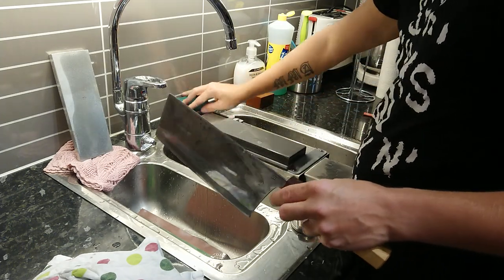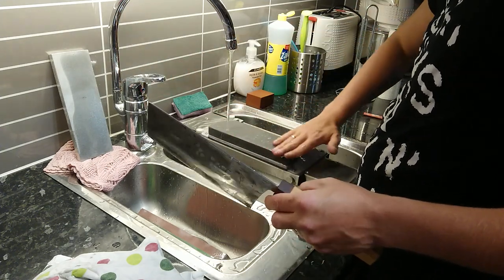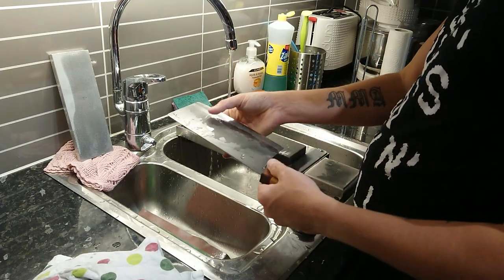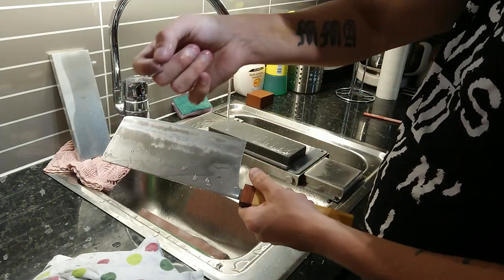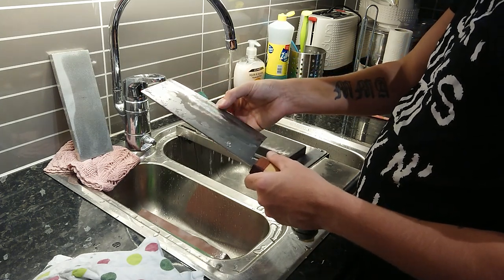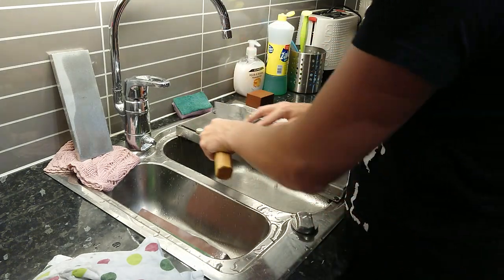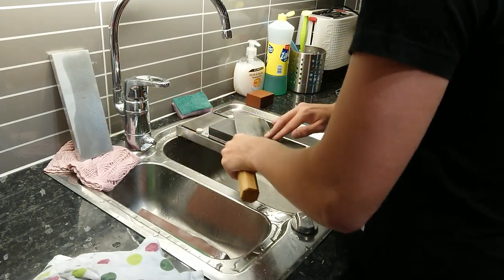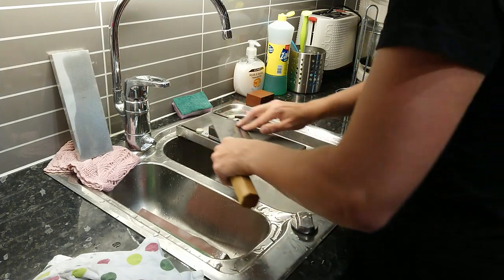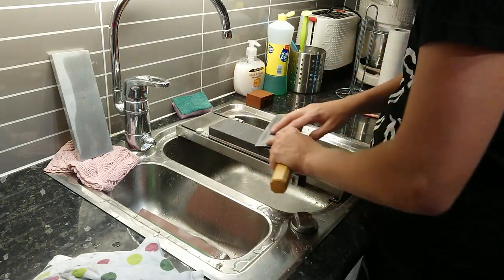Okay, there's nothing on the stone, not a tiny speck that can contaminate the feeling of the edge, doing basically this, feeling how it progresses. It's just, yeah, I'm so impressed. Woo! Going a little higher, just to get the very edge. Just barely the weight of the blade, just creating a micro bevel. Like a speck of a hair, maybe.